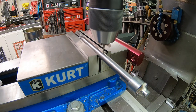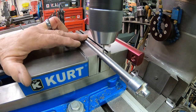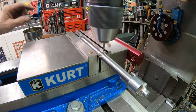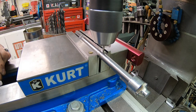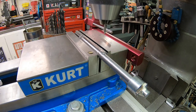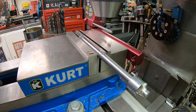I'm going to put our pin in now. I'm going just a little bit behind the female end — and this of course was the male end — and right about here was the split, centered up on the shaft. We'll just start with a little pilot hole here, and then we'll go to our 1/8. My pin is actually a thousandth bigger than the drill.